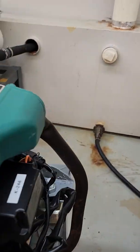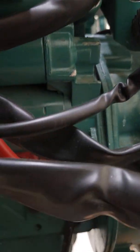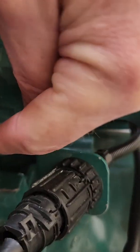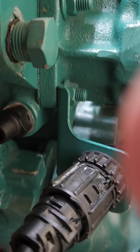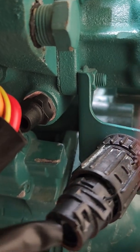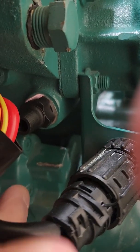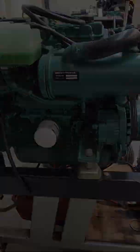Open this up and put a hose to a container to catch the coolant. You want to open up your heat exchanger filler cap, and there is another plug down on the side of the heat exchanger in the back. On the back port side, here's your other drain plug. Take that hose, put it on here, drain the coolant out, and then fill it back up once you're done. Snug those back up and fill this back up.